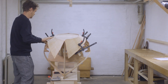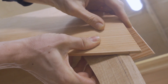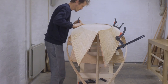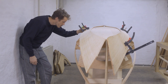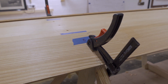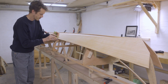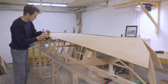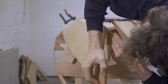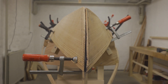Now all four garboard planks have been steam bent and cooled down and I'm figuring out their precise alignment. To do this I'm matching the pencil marks at the plank ends with the end of the stem. Once that's done I'm making a mark at the plank edge right at the midframe — this will be my reference line when installing the plank on the boat. Then I'm marking the lap line on the plank. This is the line that marks the overlap between the garboard and the middle plank. This overlap is 5 eighths or 15 millimeters. Once that's done I'm tracing the shape of the stems, which will allow me to make a cut close enough to the line that there will be room for both planks at the stems at the same time.